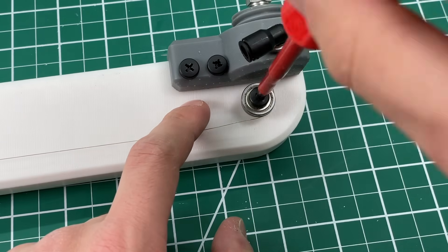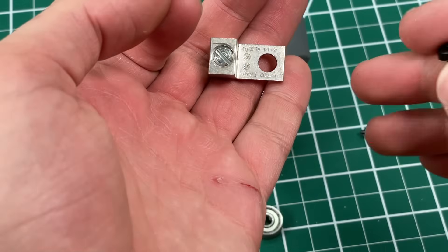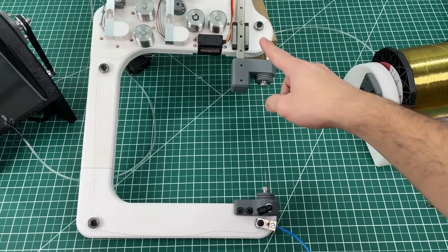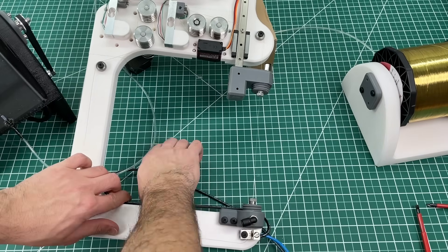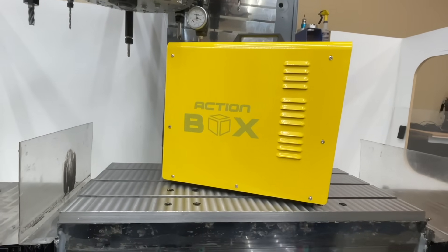We're ready to cut, so let's connect our power supply. One pole is attached to the piece we're trying to cut and the other is attached to the brass wire. We're going to add these to our guide bearings which will not affect them under normal operating conditions. After connecting the first wire down below, we also extend it up to the top for a more equal distribution of current across the cutting wire. We're using the same power supply we used in our DIY EDM sinker.